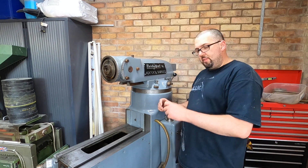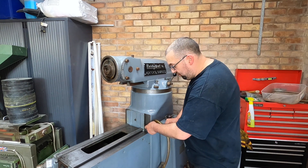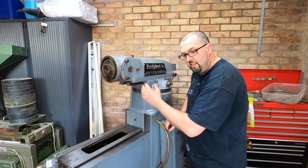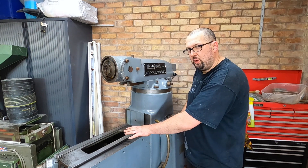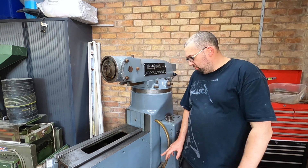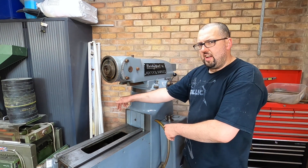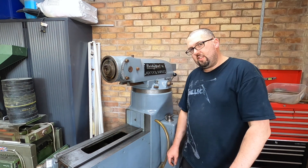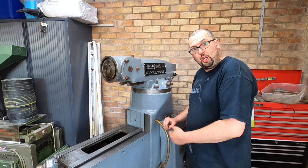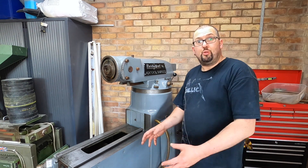As you just saw, I've put some across the top here — see if we can push a bit of the old grease and oil behind, because I don't really want to take the knee off. I'm quite sure there should be an oiler on the sides, which there isn't on either side here, so I don't know what's happened to those. I just need to double check what size they are and we can order some. We can start pumping oil in and see if we can get rid of the grease, because it should be slideway oil, not grease.